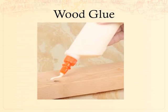Once you spread a thin layer of glue, put the other piece of material on there, and clamp the full out of it — grab a bunch of clamps, clamp it down nice and tight, and watch the glue squirt out from between the edges for a nice good bond. If you've done it right, if you try to separate those two pieces of wood after gluing, it will actually shear the wood away — the glue bond will be stronger than the wood itself. So you'll break the wood instead of separating the glue. Which is why if you know you're going to be taking a piece of scenery apart, you probably shouldn't glue it first.